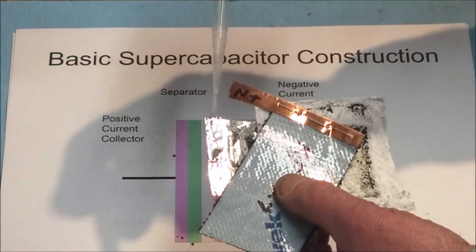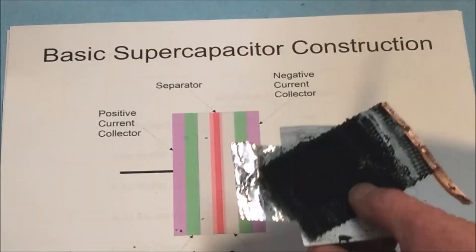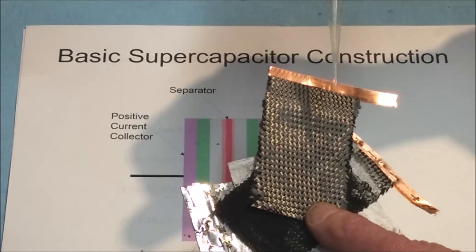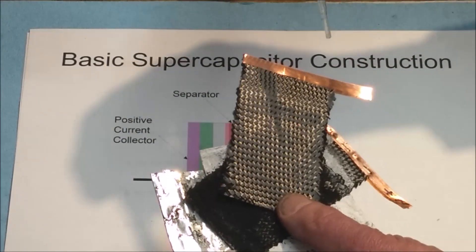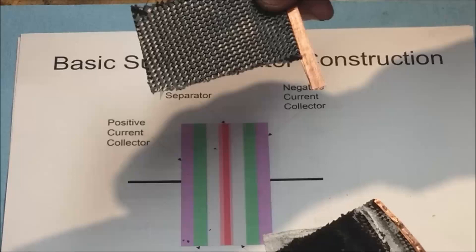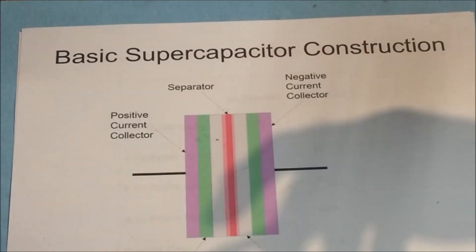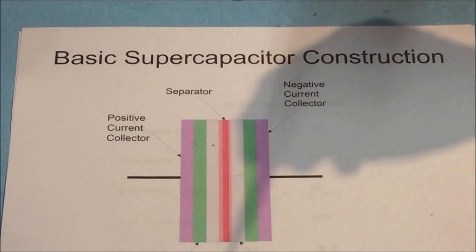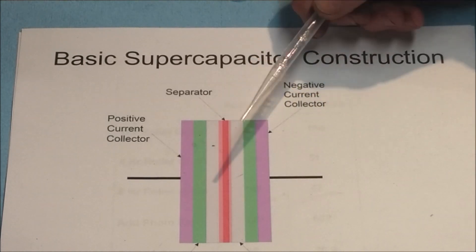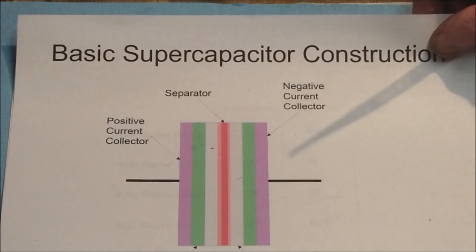Many of us have played with things like various foils — aluminum or stainless steel — metallic conductors, great for conductivity, but really going to limit the chemistry of the overall cell depending on what electrolyte will react with them. You can certainly go to the carbons like carbon cloths, which are very inert relative to the chemistry, but you're talking tens to thirty dollars a square yard, added thickness, added costs, and some handling issues. So we're looking for a better solution: conductive inks. A nice, relatively thin layer of graphite-based ink is the right path to low-cost, simple, workable materials for supercapacitors.